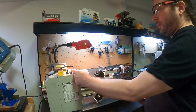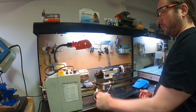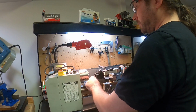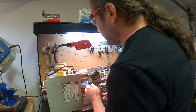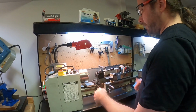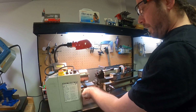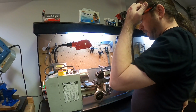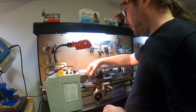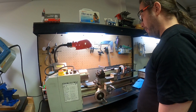With any lathe that's powered, before you turn it on, always make sure that you turn the RPM dial for the spindle to 0. Also make sure that anything is clear of the chuck, the teeth right here, because let's say I had this way over here. Well, if I turned it on, it could slam into that tool. It could cause damage to all sorts of things, not only the tool holder, the ways can get dented that way. And if you have dented ways, you're not going to be able to make a nice, accurate cut across something. You will remove material in an uneven fashion linearly.